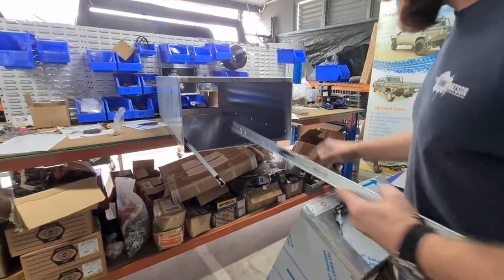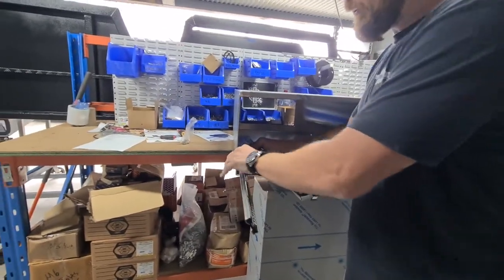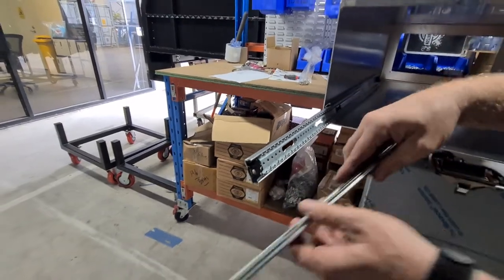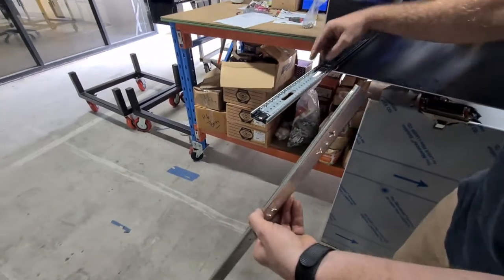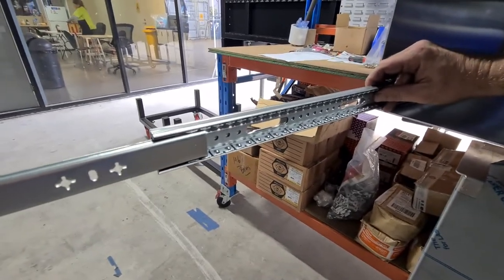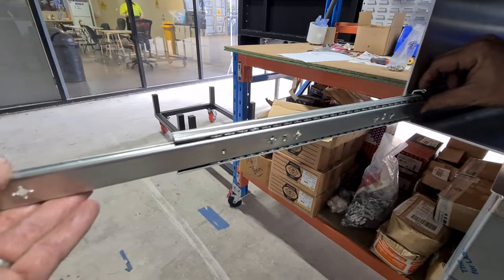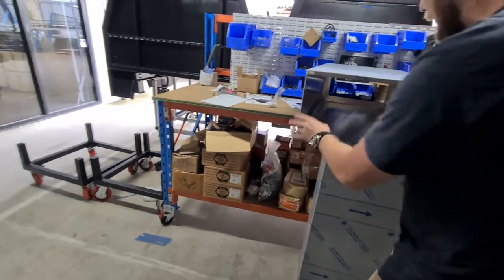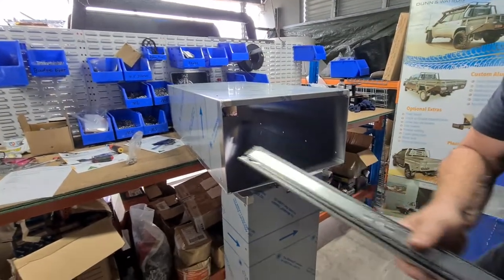Pull both slides out and put the drawer back in. What you do is pull the slide out to full extension — you've got this carriage that slides around and you want to feed that to the front. On the back of the slide you have a cut out. Keep one hand on the carriage to stop it from moving and try to line up smoothly — if you let go, it tries to move the carriage. As you go through you'll feel it click over and it's now locked in. Having done that on both sides, each drawer will now operate without coming beyond full extension because the runners have engaged.